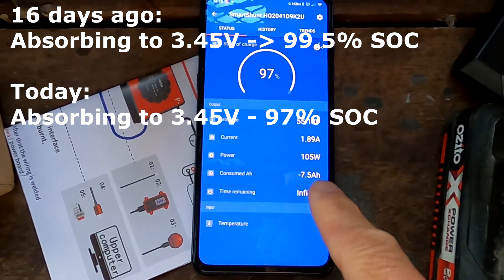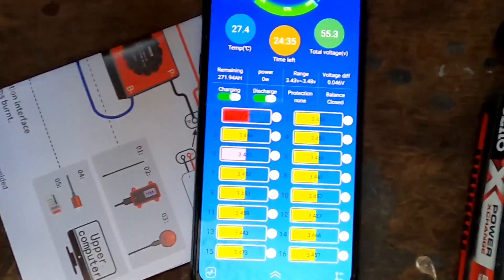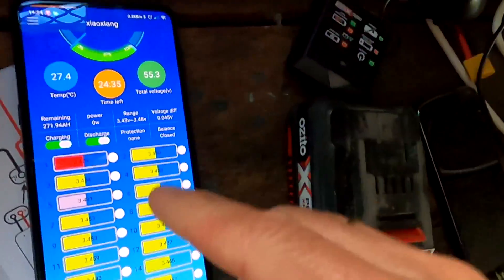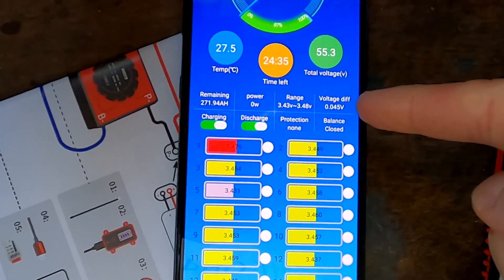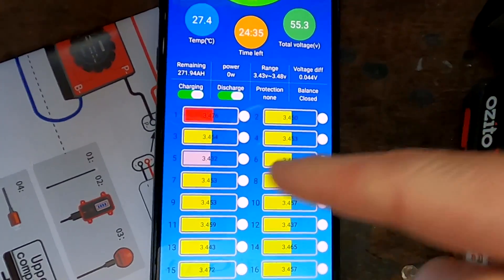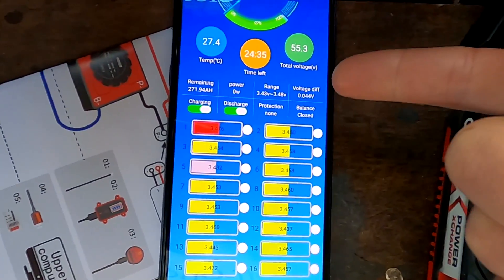At the point of calibration there were only about 1.5 amp-hours left — a very small amount — but now it's 7.5 amp-hours less than two weeks ago. I also want to show the deviation: the active balancer in the BMS is completely deactivated. We've got 44 to 45 millivolts deviation. Cell number one is high, cell number five is low — it's not the usual six, seven, and eight situation anymore, which is good, but we still have 44 millivolts deviation at 3.45 volts per cell.